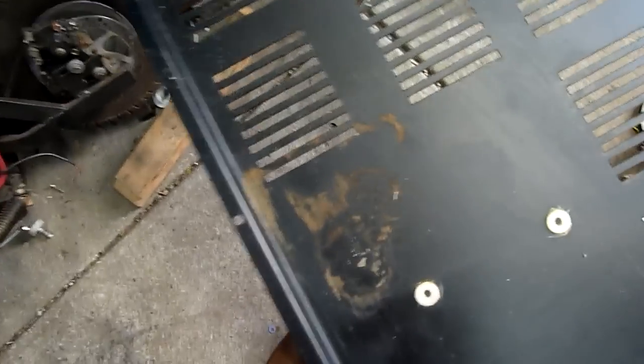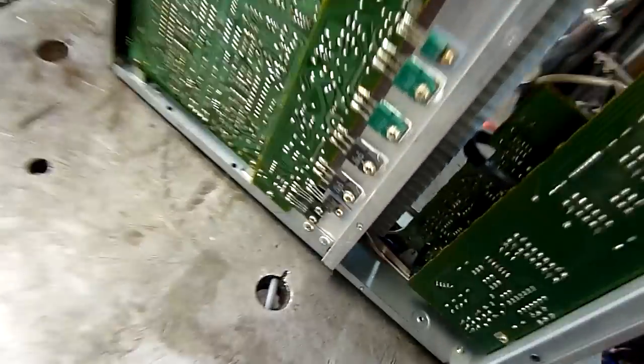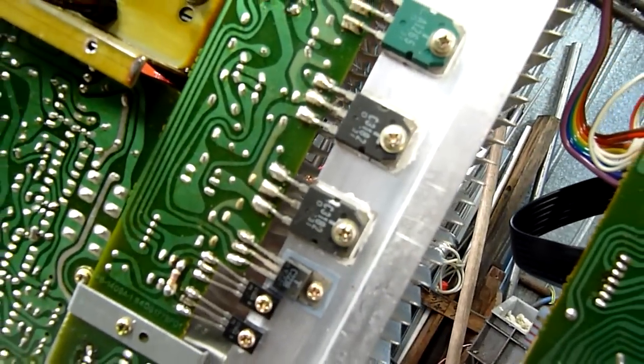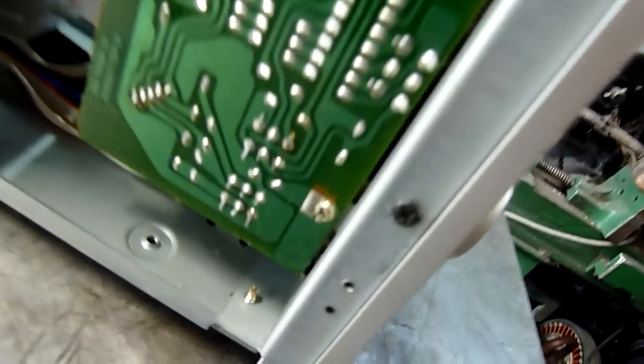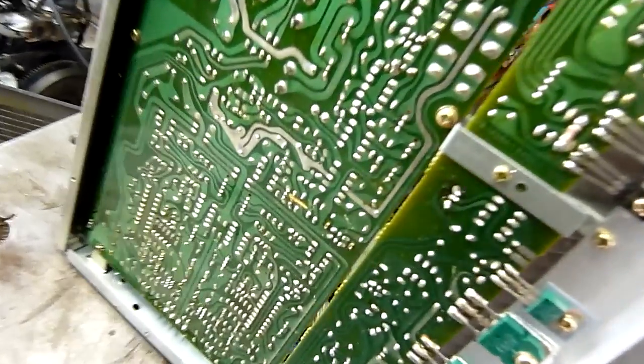The Luxman amplifier is pretty damn good. You can see where the old cap sort of vented itself on the bottom panel. The cap vented and then it just started humming, which is obviously AC coming through. But everything else looks pretty good — power transistors, pretty reasonable soldering on everything by the looks of it. Well made, it's all Japanese made.